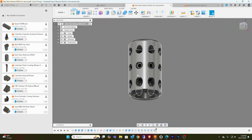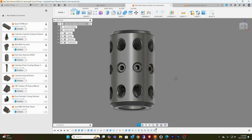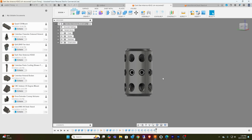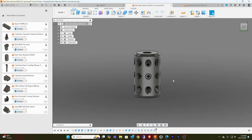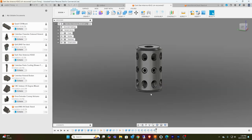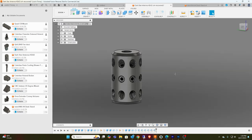I'm going to tap them with, probably, M8 thread. Then I'll probably buy some round aluminum stock, tap that, and try different lengths and sizes. I could try 108 inches, which is what you're supposed to do. It's not really a dipole, but maybe three or four downward sloping radials at 45-degree angles, all the same length. I want to make the radials the same length as the actual top antenna.